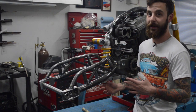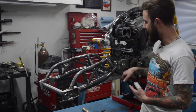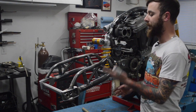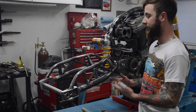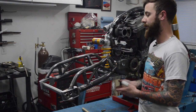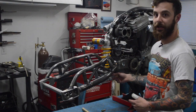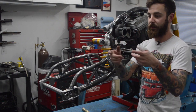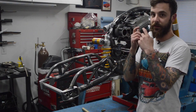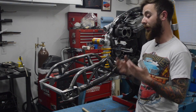We've got the rear suspension all made up and it looks pretty good. This H here is bolted to the back where the exhaust is bolted. I'm afraid that when you hit a big pothole, the forces are going to be enough that you could break the case and rip this whole thing down and have a catastrophe. So I'm putting two slots in the H and then quarter-inch flat bar is going to sweep underneath the bike and bolt to the front of the motor so it has to pull on the front and the back — that should fix everything.